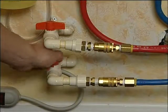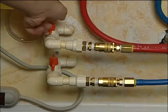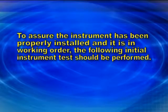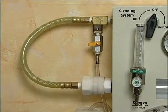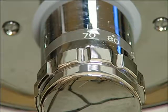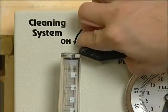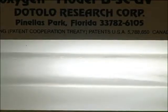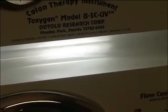Turn on the cold water supply line first, then turn on the hot water supply line and check for any leaks that might be present. To assure the instrument has been properly installed and is in working order, the following initial instrument test should be performed. Connect the cleaning system quick connect to the hygienic coupling. Turn on the master mixing valve to approximately 70 degrees, turn the waste valve on to empty, and turn the cleaning valve on, allowing water to run through the cleaning system for several minutes. This will allow the main water supply to fill and purge the air that's in the lines.